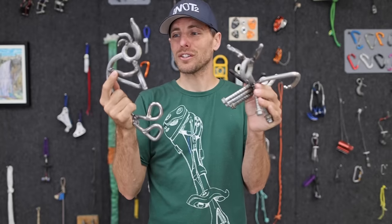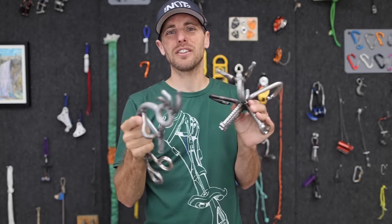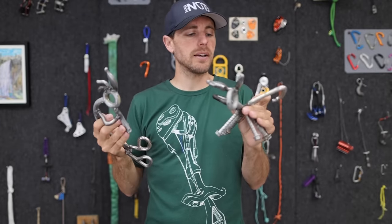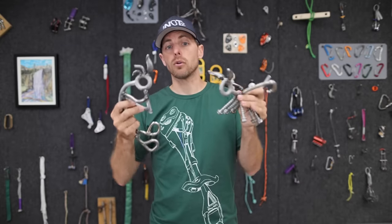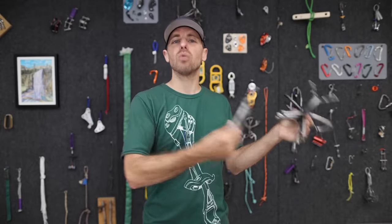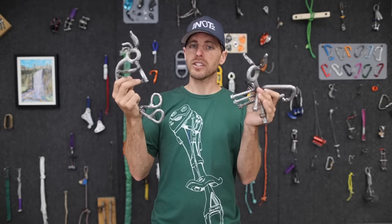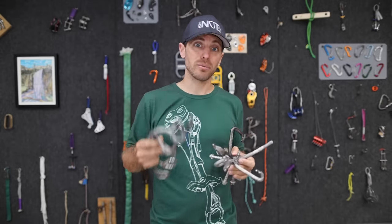David guessed 45 kilonewtons for the 10 millimeter eye bolts, but when we could break them they broke at 53. Interestingly, the glue was the weakest link and the bolt would pull out before it broke — which wasn't expected. You don't just go up a bolt size for strength, but as shown, you can get more strength from the rock with a longer or fatter bolt for surface area. There's a lot that goes into this — check out the Bolting Bible before you put in bolts.